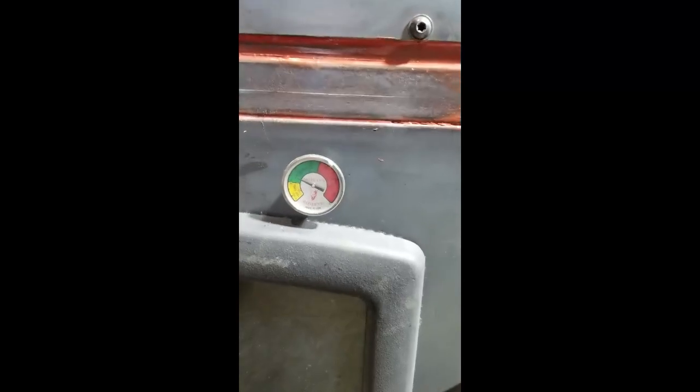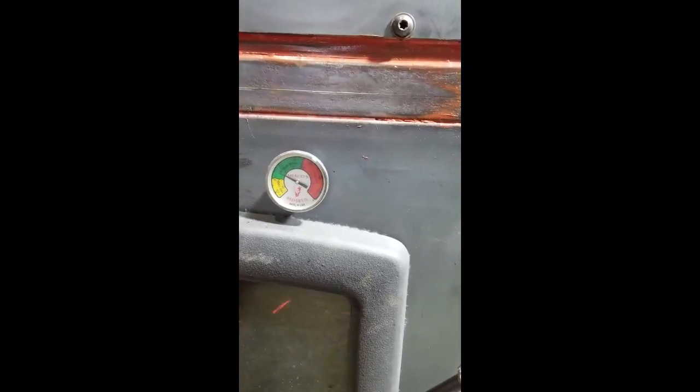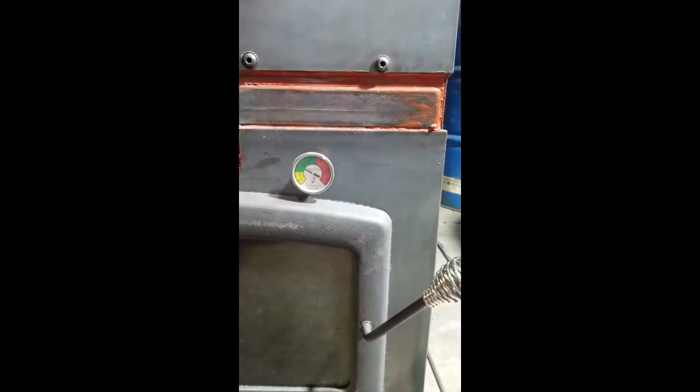As you can see she's already firing. Reflections make it really hard to see anything, but once this thing takes off it will just be a giant blowtorch in there. I have a glass door in the bottom of the stove and also an air chamber temperature gauge, so that tells me the temperature going on in there. Give this thing about a minute and it'll be up to about 850, 900 degrees — it'll wrap that needle right around. I need to get a larger scale thermometer; that one only does 850.